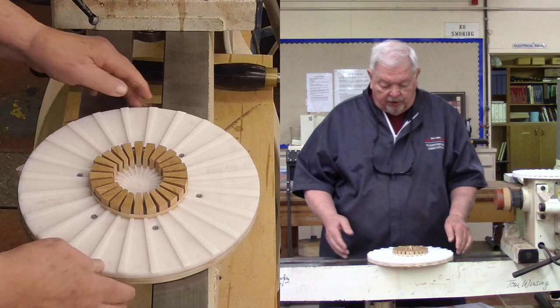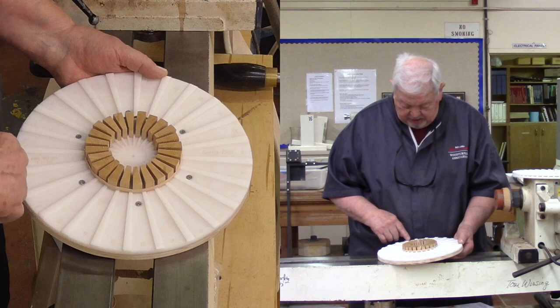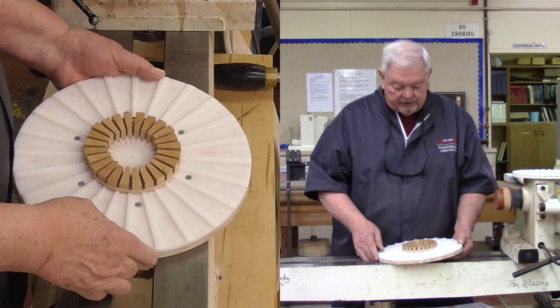So this is what it begins to look like when you're using one of these Seg Easy plates. This is a Seg Easy plate that's a 24-4, which means out of the 15 degree included angle, we take away 4 degrees. That leaves 11. And so my miter cuts are 5.5 degrees, flip 5.5 degrees, making an 11 degree included angle. And that's what you've got here.